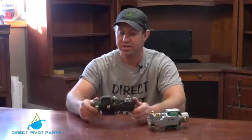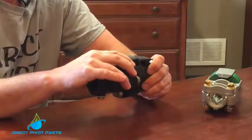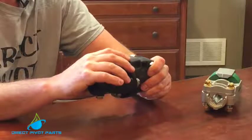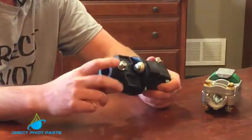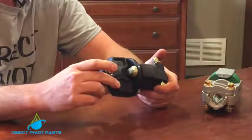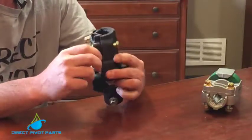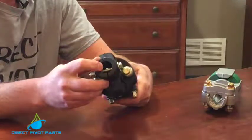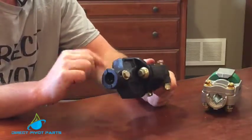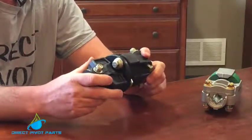The other new product we've had really good luck with is an XCAD coupler. It uses a polyurethane disc that is extremely tough. It's actually rated for more torque than the UMC. It's held on by three 9/16 lock bolts. It'll work from half inch to inch and an eighth — same principle as the UMC. It uses the inch and an eighth round on one side and will unbolt in the center to that disc. These are finding very long lifespans with very high torque on them.